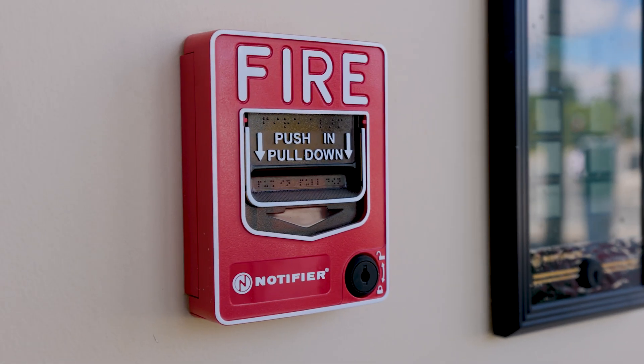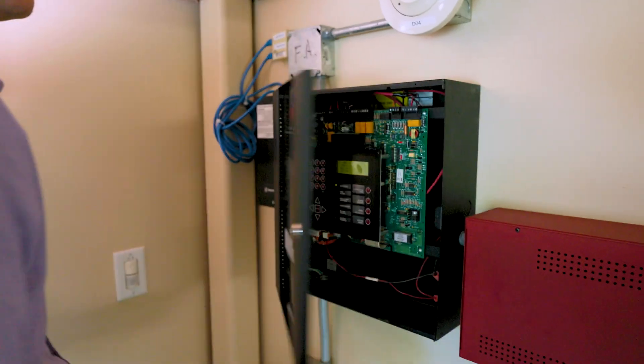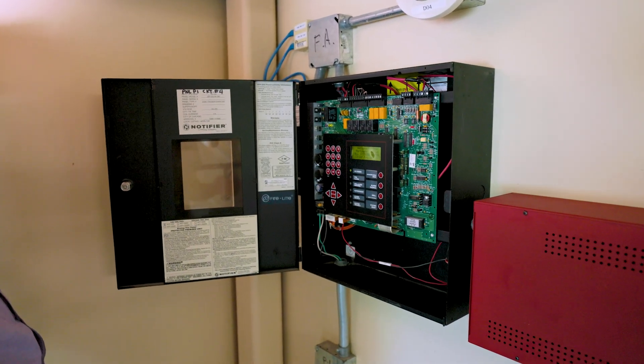For fire and burglar alarms, you may require customer involvement. You'll need to call the customer's alarm monitoring service, or have the on-site contact do so while you're present. There are four steps to testing. Step one: verify the alarm status panel shows normal or in service. Step two: have the alarm service provider put the device in test mode. You'll need the account number and PIN — sometimes this info is on the alarm box itself. If the panel does not show normal or in service, contact UMA support for troubleshooting steps. Step three: sometimes an alarm company will ask how long the system should be in test mode. Explain that the installer or customer will call at the conclusion of installation to end test mode.